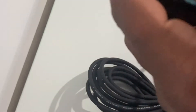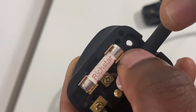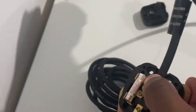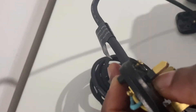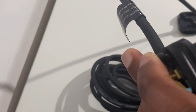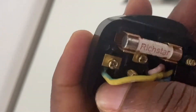The next step is to safeguard the flex on the wire — securing the sheath and making sure that when you yank the wire or the plug it doesn't pull straight onto the pins. We will be screwing a black plastic piece on the other side with two screws to secure the wire into position, clamping the sheath in between the black plastic and the plug.